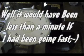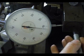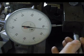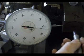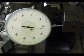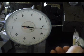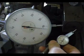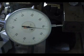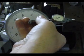And if you actually want to set a point, you can do that centre method, or another way is if you drill a hole, check it's round, and then use an indicator with a finger. You use an indicator like this. You can indicate in, or you can put a dowel in the end and indicate with a gauge. That works quite a bit of the time. In fact, I use one of these most of the time on external diameters.